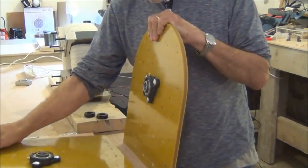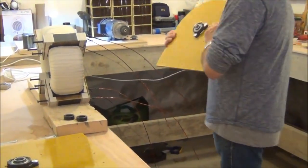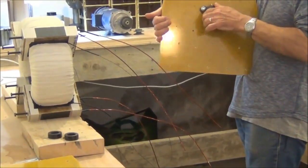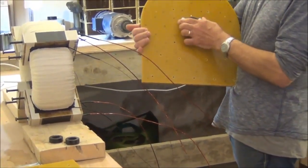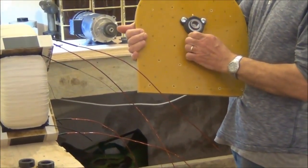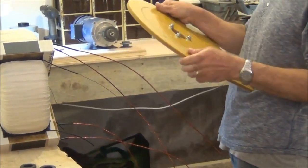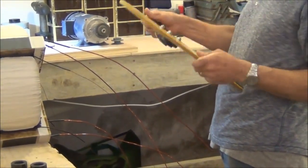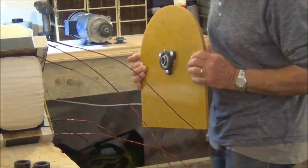The rear plate we're going to put together first. This bearing is a little bit loose. Now it's possible when we get this together that there won't be enough adjustability here. So we may have to take it back apart and make the mounting holes larger to get more adjustment room. We'll see where we end up.